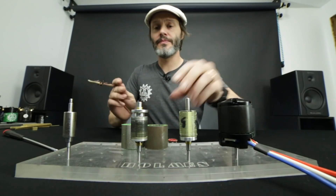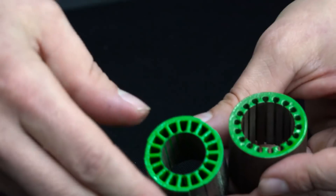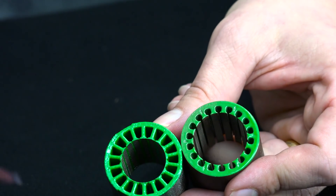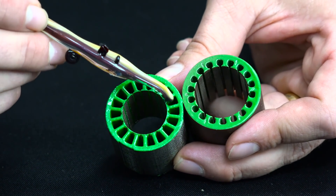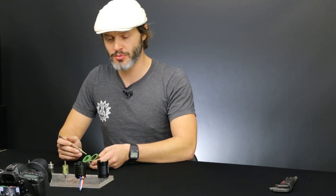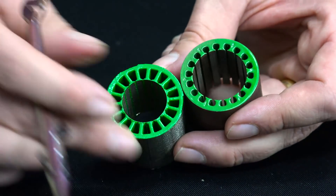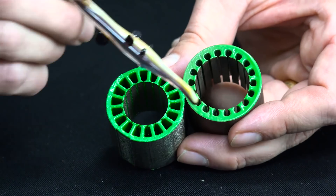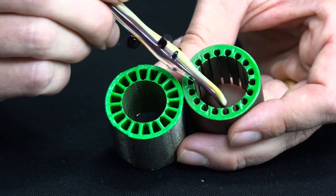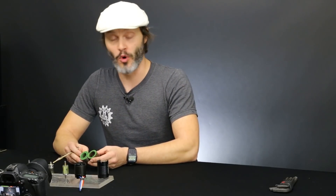Here's another stator we can look at. This particular stator is 18 slots, but you can see there's a difference between them. We have a much deeper slot depth on this one, but a thinner section of iron around the back — we'd call that the back iron of the motor in a brushless motor. It's built into the stator, whereas on a brush motor the can is the back iron. You can see the interior diameter is different, the cross section for copper is different, and the shape of the tooth is completely different. Although both would be 18-slot motors, you might think they'd perform similarly — they do not. That's where the black magic of motors comes in.